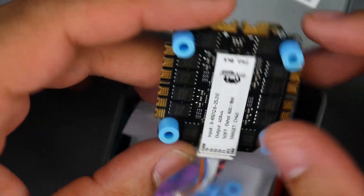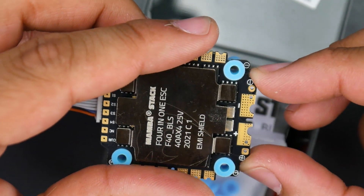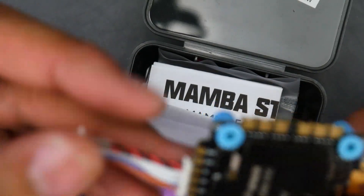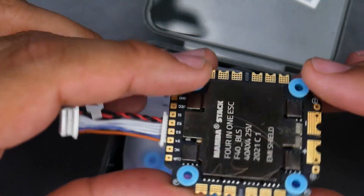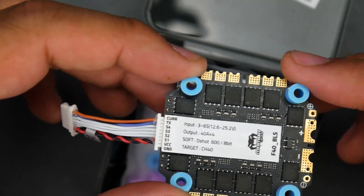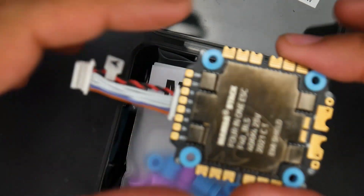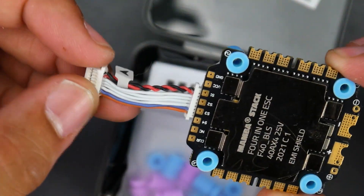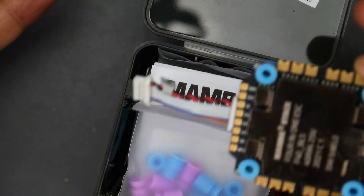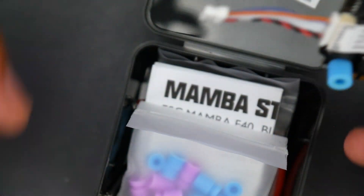Be careful when soldering — don't keep the iron too long on these pads because they are vias with holes, meaning solder can wick through and you'll find a blob on the other side. Always double-check both sides after soldering. There are also holes for a capacitor and extra battery voltage pads if you need them. The overall design is proven, but what concerns me with new ESC designs is dead time and software tuning — problems like Sky Stars and some T-Motor designs have had with dead timing can cause desyncs, more noise, or reduced lifespan.